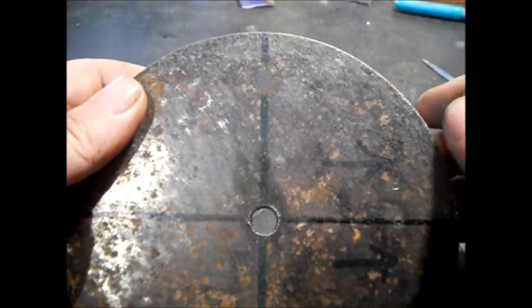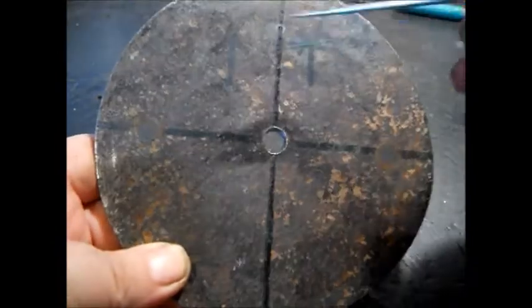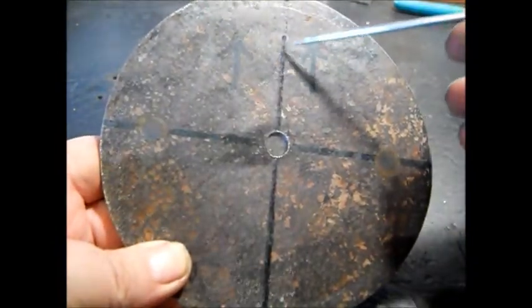Said these holes will be bigger than a 3/8 eventually, because those are 1/2 inch bolt holes. So we're going to go 3/8. Said mark everything. I know this is going towards what I'm calling the front of the vise, which it is. It's not the back where the anvil is.